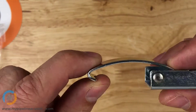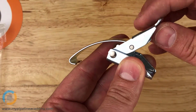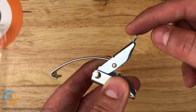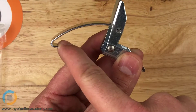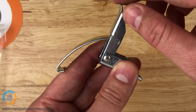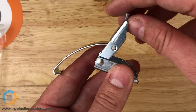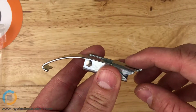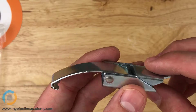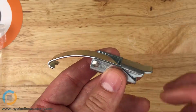It might not be perfectly straight, but it'll straighten out a little bit, and there's going to be tension in there. So as you pull that latch closed, you're going to encounter resistance right here — resistance because this end is hooked over against a rigid catch that's not going to move. You're pulling it down, this starts straightening out, you feel that resistance, and then it kind of locks in place. At that point, your draw latch is closed and you've securely latched whatever you're latching.